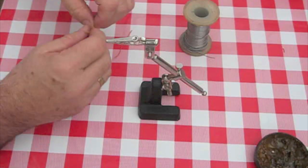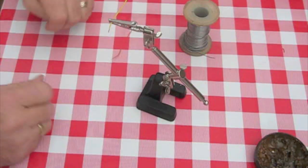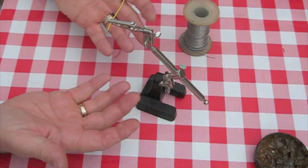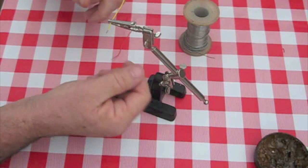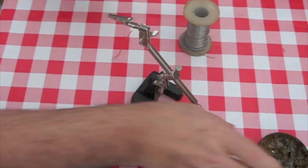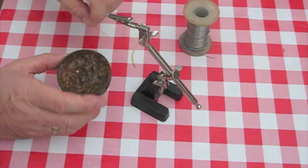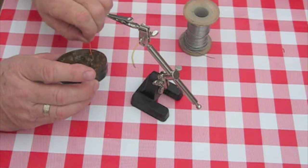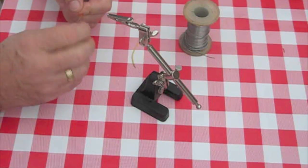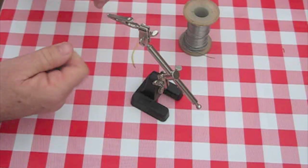Now, if we just take the piece of wire and put it in the clamp — that's how to do it because you've only got two hands. If you've got three it's easy, but there's not many people with three hands, so that's what the clamp is for. Just get the flux, dip your wire into the flux. We do both bits, and what the flux does is it actually cleans the wire and stops grease getting into the joint.